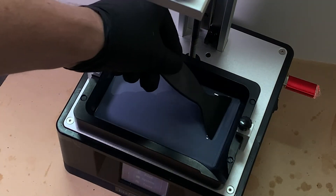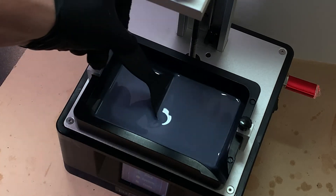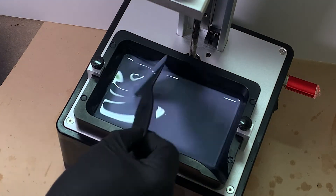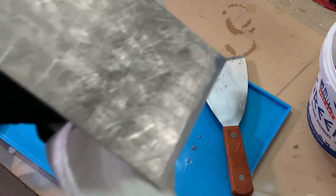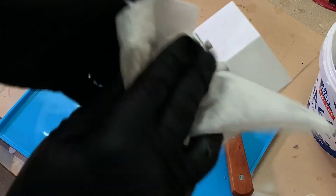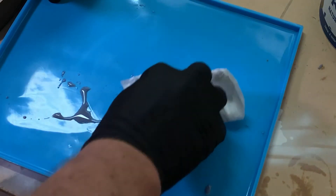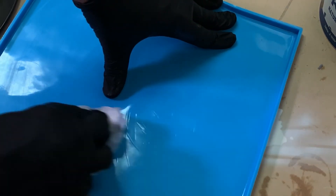This is the first step of cleanup. Using a small plastic spatula, I rub it across the bottom of the resin vat to check for any imperfections. If you get a misprint, you can get cured resin on the bottom of the vat — leaving it there will cause real issues with subsequent prints. Now it's time to clean the build plate. I'd suggest a fresh pair of gloves as you wipe the build plate over, using isopropanol or methylated spirits to get rid of all the resin, ready for the next print. Then just use paper towels to clean up the mat — these mats are fantastic, very easy to clean, and only cost a few bucks off Amazon.